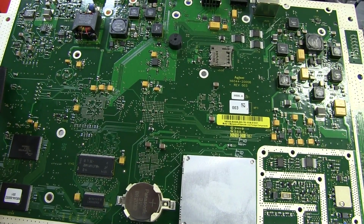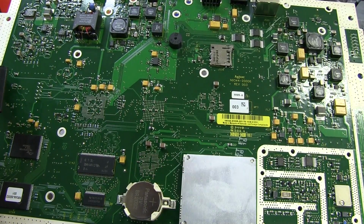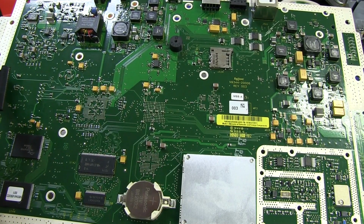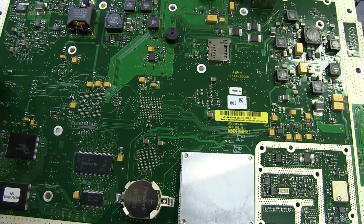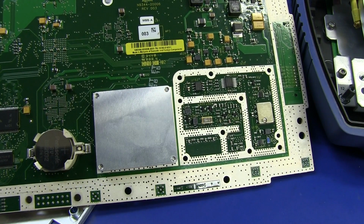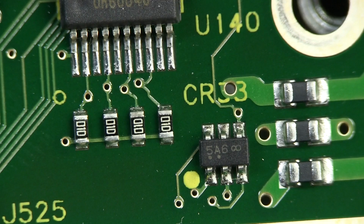So they just assemble this board and do the basic programming of the FPGAs and all the programmable devices, and then they just do thorough software-defined tests and calibration, all that sort of stuff. So they're not actually doing a huge amount of tests at the bare board level, I suspect. And it goes without saying, I think that the soldering on this board is first class.